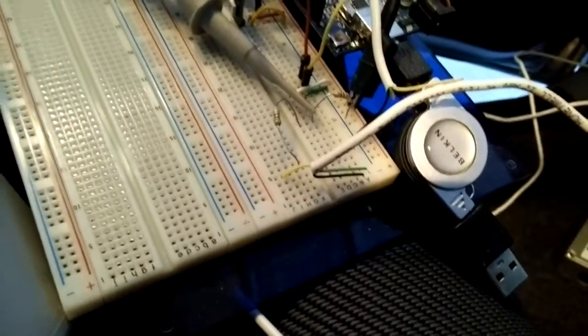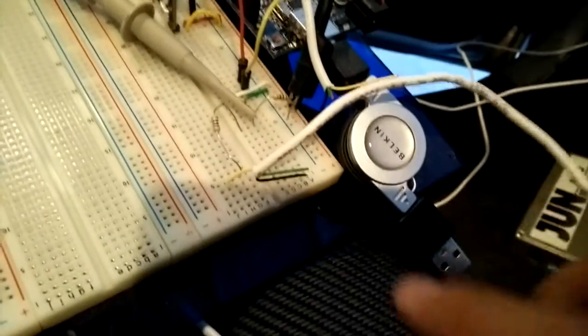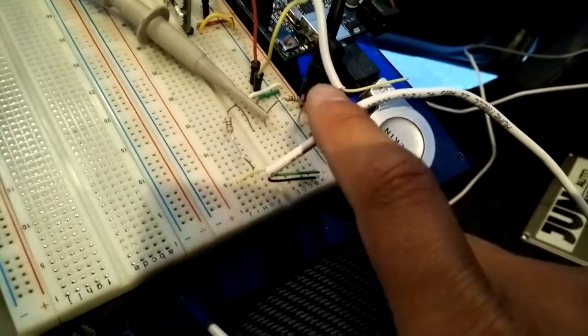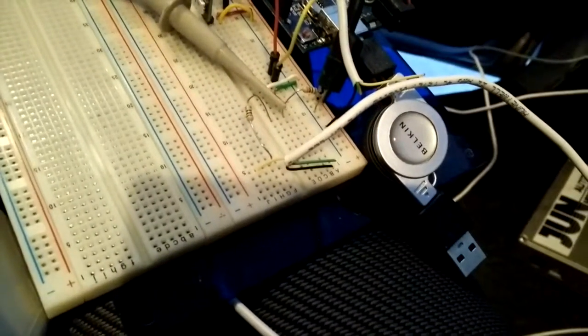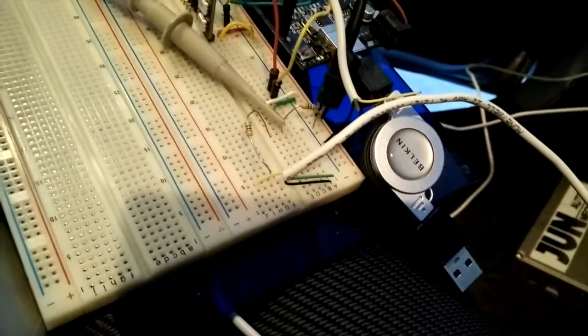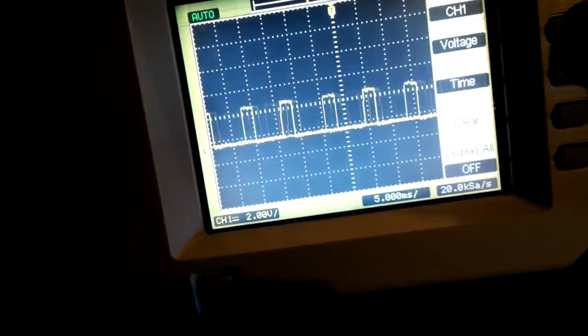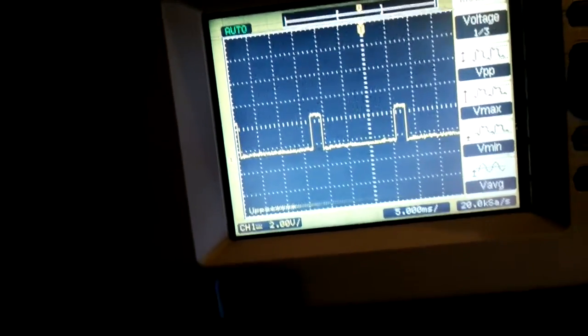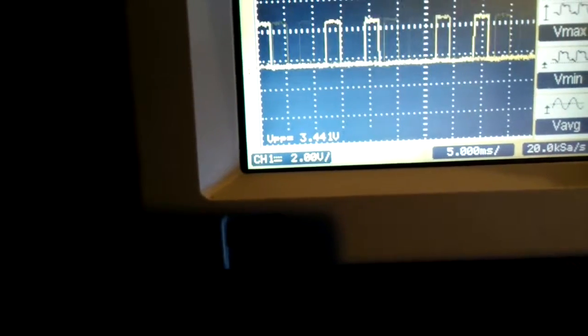Here's my simple circuit to step down the voltage from 7 to under 5 volts. This is where the tachometer signal is coming in, and it goes through this voltage divider. On the other end of the voltage divider is ground, and I'm taking the signal from the middle. I'm using two 1 megaohm resistors, which cuts the signal in half. I should see something around 3 to 3.5 volts when the car is on. Measuring the peak-to-peak voltage — we see about 3.4 volts, which is perfect for the microcontroller.